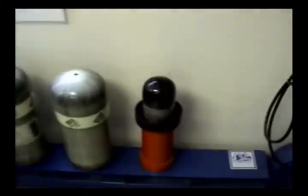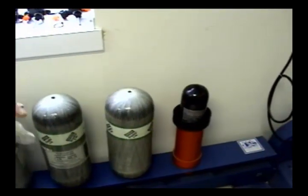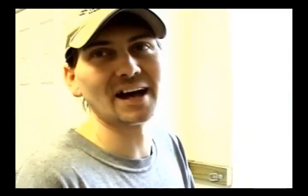The metal will dry in about 5 minutes; larger ones dry in about 8 to 10 minutes. It's high-pressure heated air — not even as hot as a hair dryer, maybe around 70 to 75 degrees. After drying, we look at the threads to make sure they didn't get damaged in the process of the hydro test.